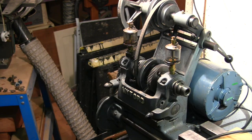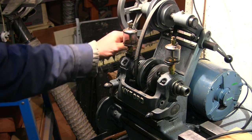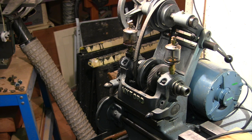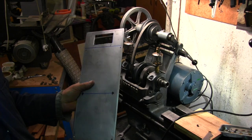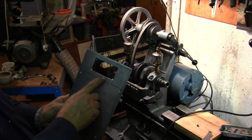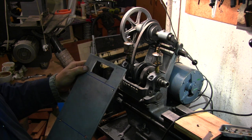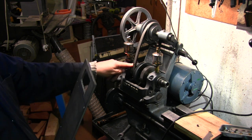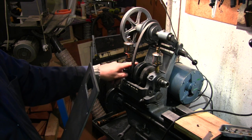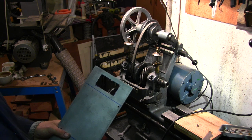The motor is on, it's all wired up, it is working. I had to cut a keyway in the pulley on the end of the motor shaft but that was a bit of a pain — but it's all done now. I'm making this plate to mount the actual controller on. I've got this cut out here for a little hall effect digital tachometer that I've got on my wood lathe at the moment. I'm going to change it over and put it on this. It means I've got to mount a bracket somewhere up there to try and fit a magnet on here somehow. This is aluminium which is a pain so I'll have to Araldite it or something on there. Still got to figure that one out — a bit of a pain in the arse but I thought I'd do it while I'm doing this.